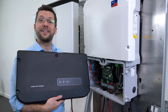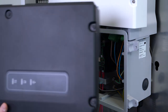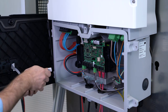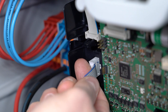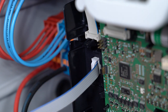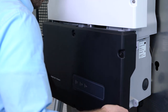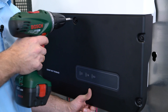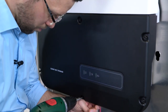We can now complete the installation by closing the inverter's lower cover. During this process please ensure to hold the lid and then plug the display cable into the socket on the communication assembly. Position the lower cover at a slight angle. Tighten all screws crosswise — to make the installation easier I recommend tightening the screws in the center first.